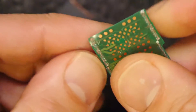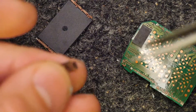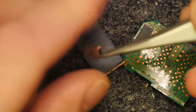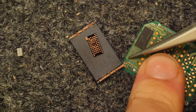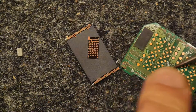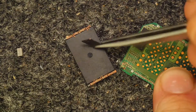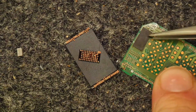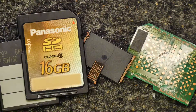So there we go — nothing but standard flash chips and two controllers. These larger chips are in normal inline pin packages, but these smaller ones are far more interesting — they're BGA, ball grid array chips. The pins are all underneath the chip in a matrix, as opposed to just along the edge. These can be really tricky if you're doing your own PCB prototyping — they don't want to go on the board easily and it's very hard to rework them later.